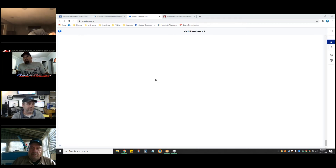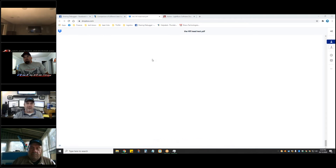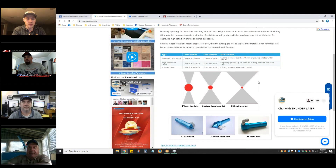A lot of people think you need 600 or 800 DPI, but even if your image is that resolution it's not always good for the laser — more like 200 to 300. The biggest thing people don't understand is you can't use a tiny file for doing a photo engraving. You need something substantial — a couple thousand kilobytes at minimum — otherwise it'll be grainy and blurry, and if you have to enlarge it, it's even worse.